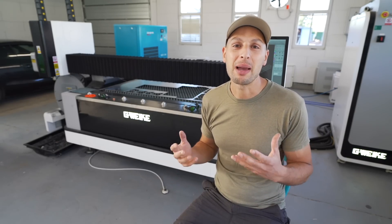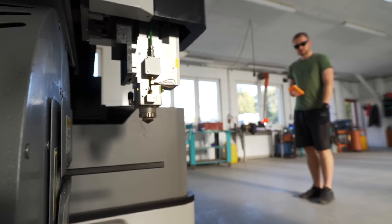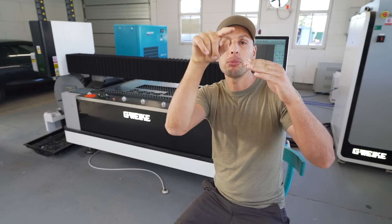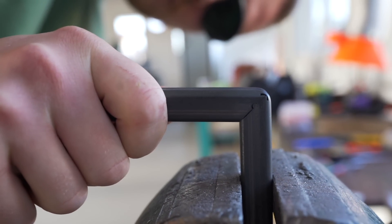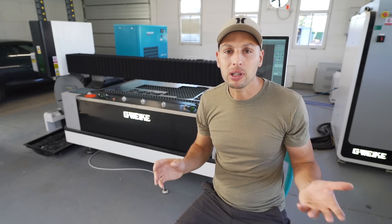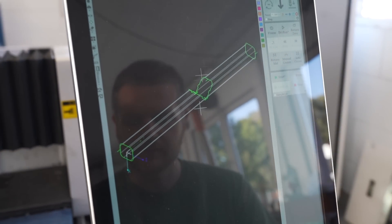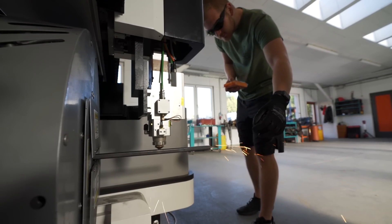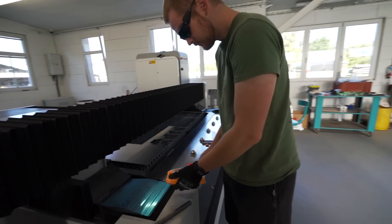We finally have a little bit more time to play with the CNC. We're testing the tube cutting machine, particularly testing the square tubing joints. That means you have a square tube, you cut a bit of an angle with a notch, so you can just take the square tube, bend it 90 degrees and end up with a nice 90-degree angle. That saves a lot of time when assembling such profiles. Making 2D files is so easy for us after going through the intense training when building our camper van. The amount of 3D models was just mind-boggling, but it truly pushed our skills to another level. Now we use the CNC very quickly, so it feels like a human body extension.